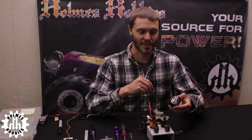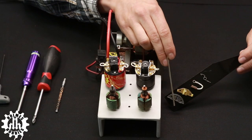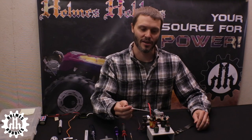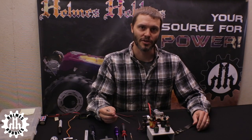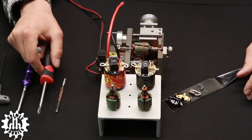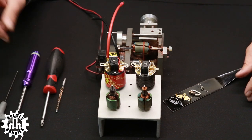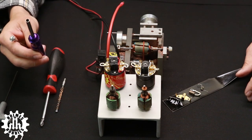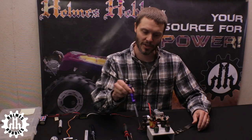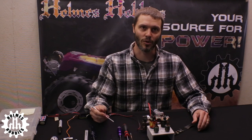What we are going to show you is the parts of a brushed rebuildable motor, which include the upper and lower hoods, the brush, and the spring. These two examples are rebuildable motors. To rebuild the motors you will need a few tools: generally a Phillips head screwdriver on some brands, and for our puller brush motors you will need a two millimeter Allen head. If you'd like to take the brush spring posts off, you'll need these little nut drivers — Integy makes ones specifically for taking the brush posts off, with good clearance.